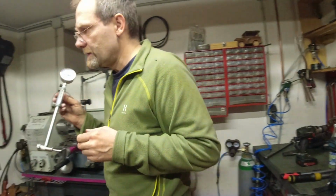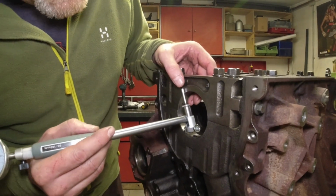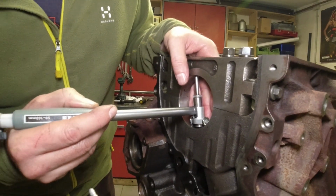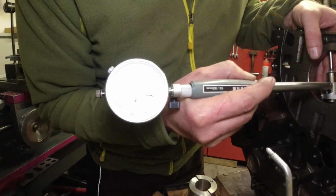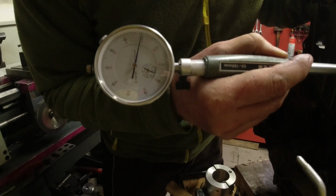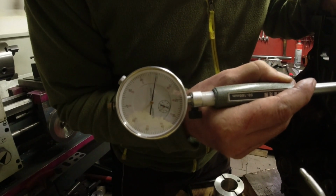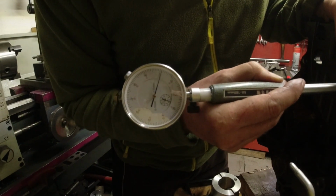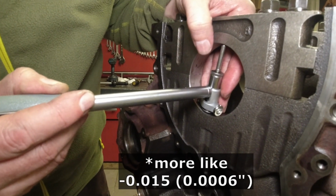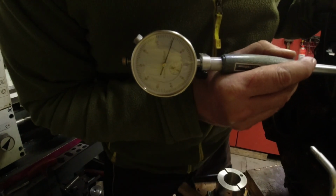in my gauge. Here we got the measurement of the original Ford machine bore, which did luckily not get destroyed. And you can see here, now go to the gauge, you can see this is a little bit in the minus. Depending on where I go inside the bore, I can even see that it's not completely plain, but it's, I would say, minus 200. On the other side of the oil bore, you have to go over here on the needle. It's the same, minus 200.